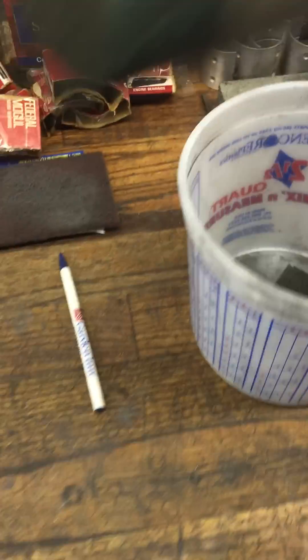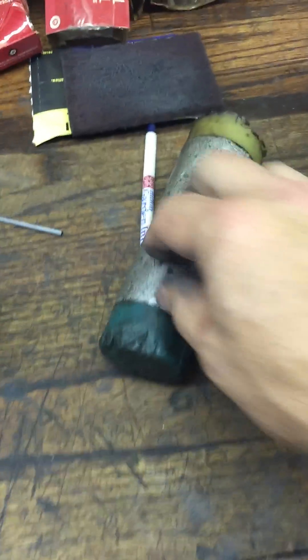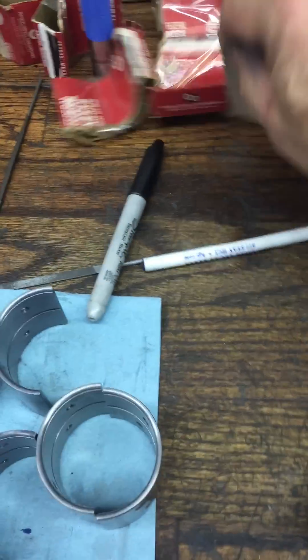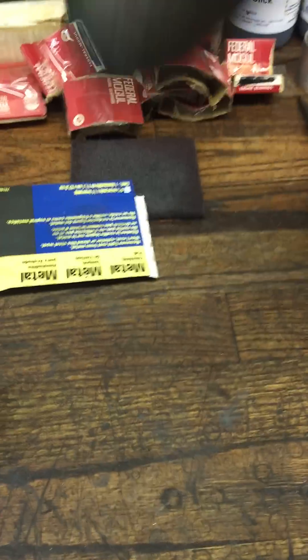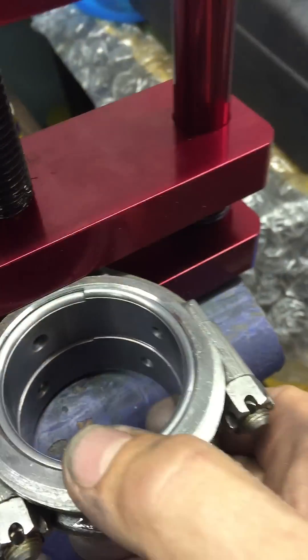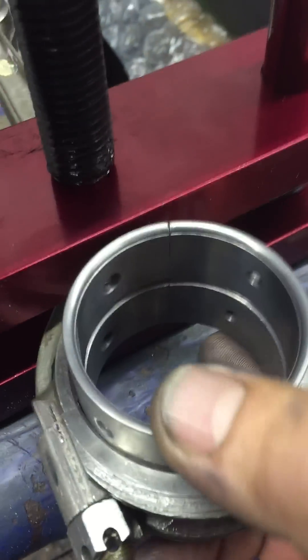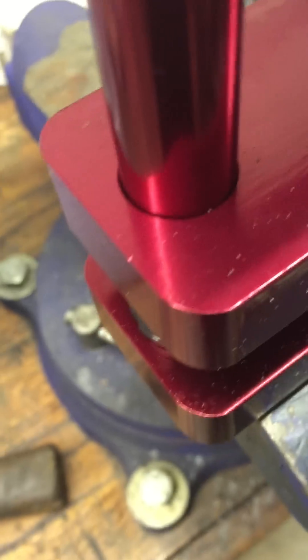What I had done is I used this hammer over here with a piece of cardboard on top of the band. These bearings were too narrow on the end, so I gave them a whack on the top to spread them out a little bit. That's what enabled them to float. I also used a lot of scotch brite and polished all the surfaces.